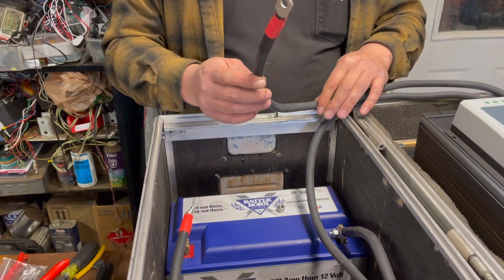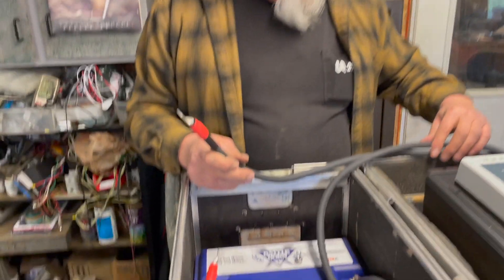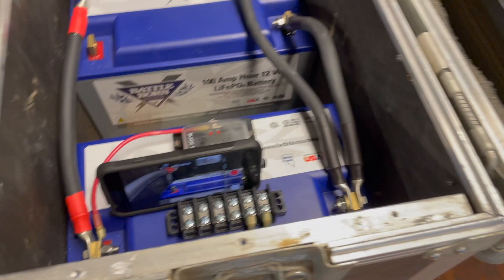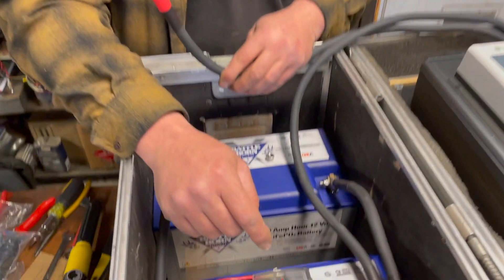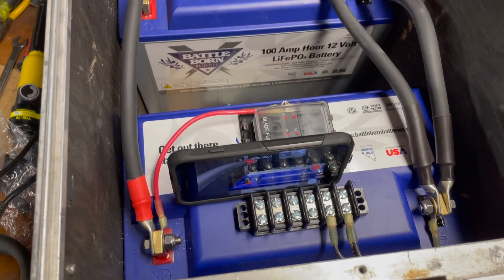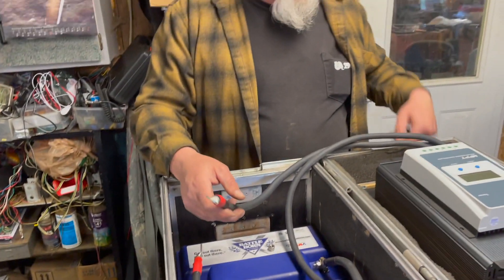We've got most all of the cables cut. I've cut these cables, heat-shrunk the ends, and used the hydraulic crimper to crimp these on. This turned out really nice. We laid this out so that when it folds up we're going to have enough slack — I don't want a bunch of stress on the terminals of the inverter from folding or unfolding. Inside here we put a smaller fuse block and a ground block, and we're about ready to apply power to this.